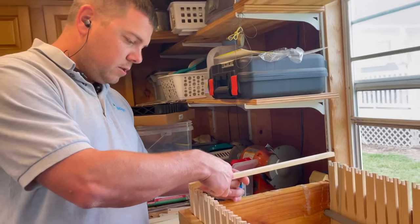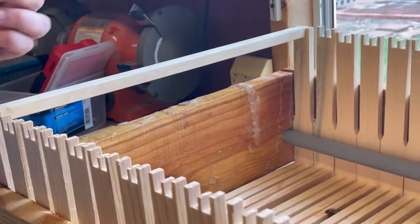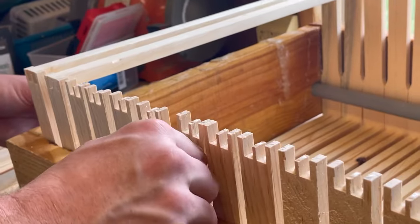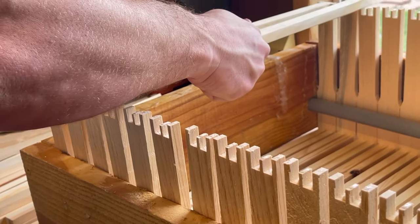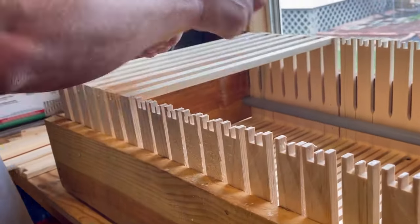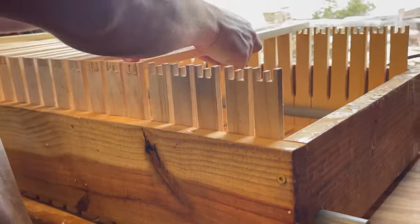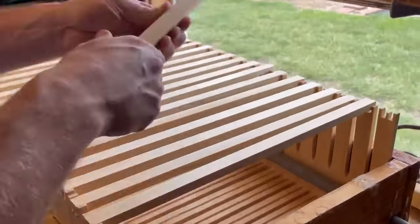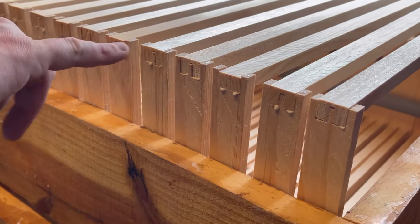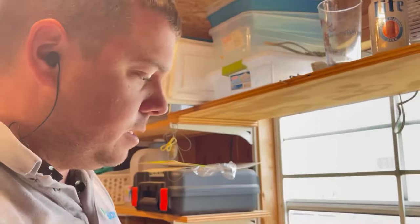I always start by making sure this side is flush right here, and I don't really worry about the other side — I'll show you why in a couple minutes. For being efficient, I'm going to punch staples down this whole side right here, so from the word go I want this side correct. There's a good example — I can see all the wood glue kind of mashing out in that joint. I'm going to staple these up, then flip it around.